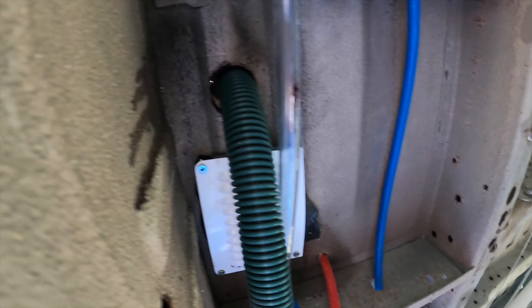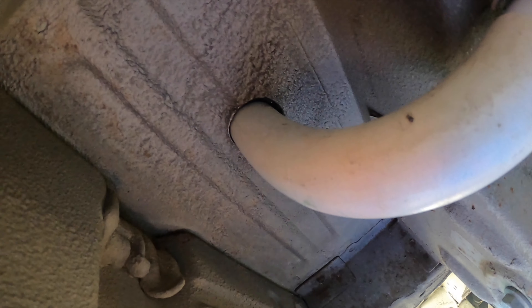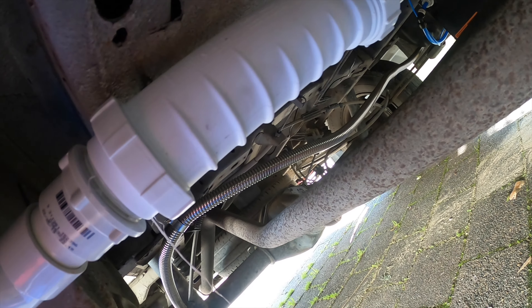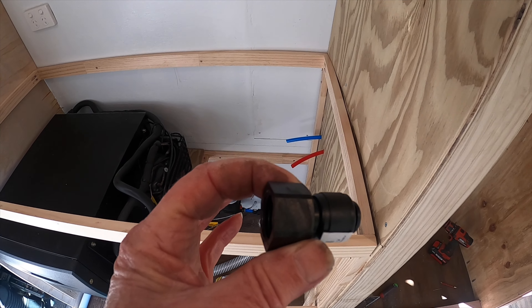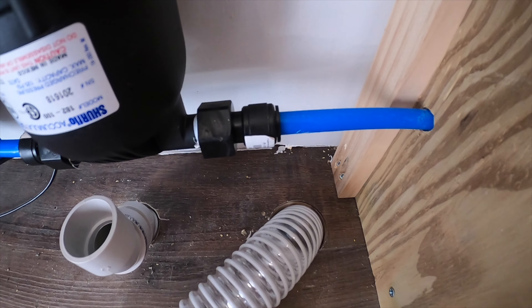Underneath, we've got the waste pipe from the kitchen sink coming out through the floor, then through a poly tube into a tee piece. The pipe from the shower comes into the other junction of the tee piece, and out through an Evo-Flow trap — water goes through and it's self-sealed — then it carries on out to the waste tank. This is hopefully the missing link to finish off our plumbing — circuit complete!